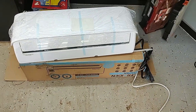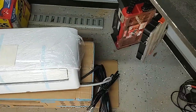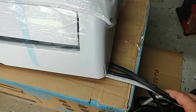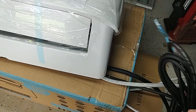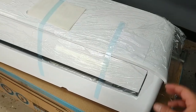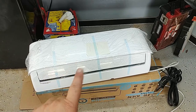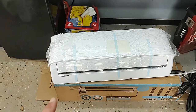I took the TV off the wall and opened up the air handler. This is new to me because I'm doing a DIY AC — all this stuff comes pre-wired, which is unusual to me. Usually I wire all this stuff myself, which is nice. I just hope this wire is going to be long enough. My dislike about something being pre-terminated is if the wire is too long you see bundled-up wires, and that's not going to fly with me — I'll cut it shorter and re-terminate it. Here's a trick: you can take this cover off right here and make it way easier to install on the wall.